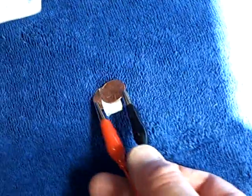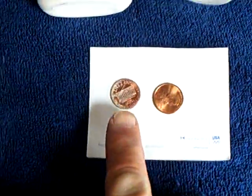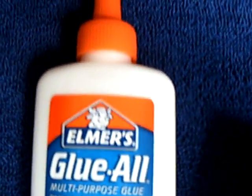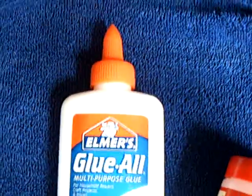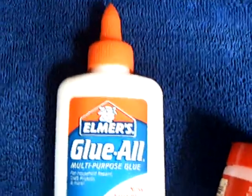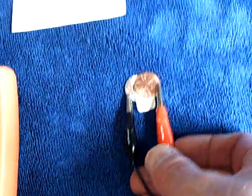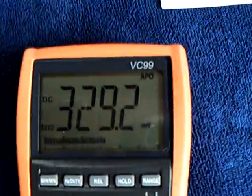I just thought this was a real simple experiment for people to try — anybody could do this. Just take a couple of US pennies, sand off the copper to create zinc, so you've got a zinc copper cell. Use a piece of white paper, just regular white paper, and Elmer's Glue All. I do recommend you use this particular one — IB Pointless Glue Batteries uses this, and it is different than the school glue, it's some different compound. Then mix it with the alum — that's A-L-U-M, you buy it at the grocery store. Make up one of these little penny batteries, glue it together, let it dry, and you're going to have a standing voltage. Then try putting it in the sun and watch your voltmeter go up.